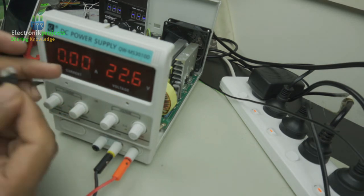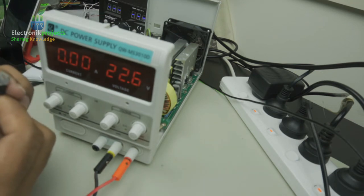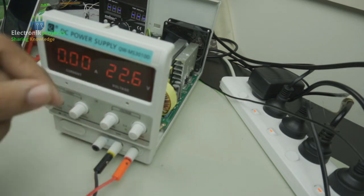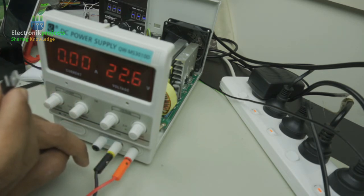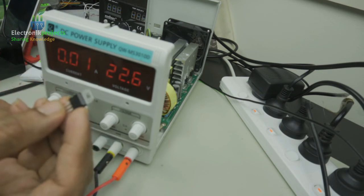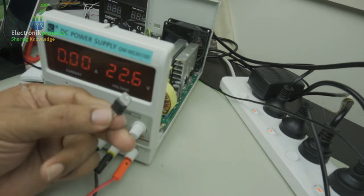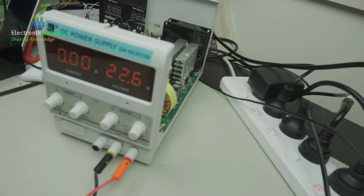As you can see, I've changed only the MOSFET that was associated with the voltage regulation, as I said earlier, and this is common with the MS3010D. If you're picking the voltage more than 20 volts and your terminals get short circuited, the little buddy inside, the MOSFET which controls the voltage, is going to go away. It's hardly $2. You can get it on eBay for a pack of 5 for $10. I got it from eBay as well. You change only that MOSFET, and the MOSFET is 75NF75 if I'm not wrong.